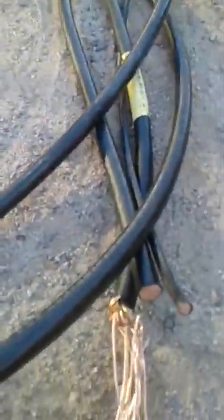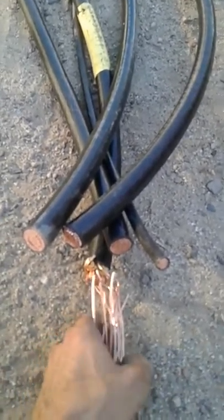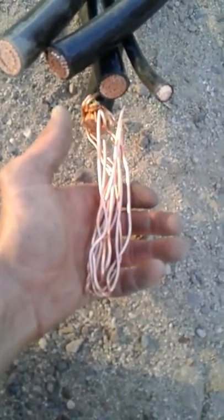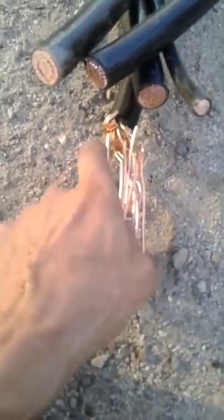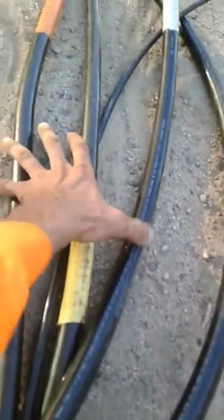We had to pull all these wires together inside of a four inch pipe. This is how we connected them: we pulled a rope into the pipes and we connected these wires to that rope. We used duct tape to just duct tape the whole thing together. When we do that, we start with the sticky side down in like one wrap. Then we flip the roll around and wrap it backwards. That way the sticky side is out. We wrap it around all the wires — down to about here — you want a good foot and a half or so of wrap on there.